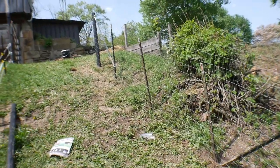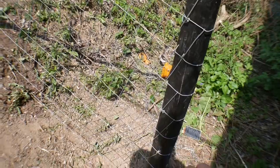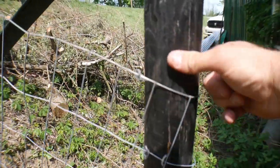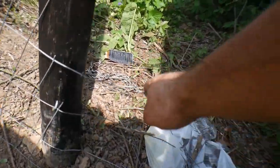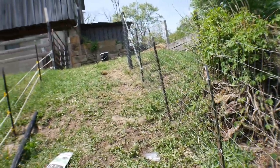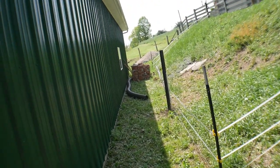There's the fence going up and it's relatively tight. What I ended up doing was putting some staples in this fence as tight as I could get them, then went ahead and took the come-along off. Now I'm stripping down the wire, wrapping it around the post and tightening it up. Right there you can see it — I've got some wire stripped and I'm going to wrap them around. That'll do it for this end of the back, and then we can put our brace over this way and start heading down the bottom of the bank.